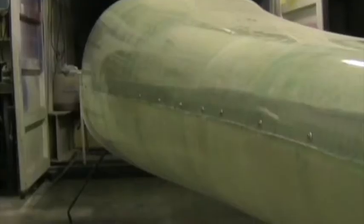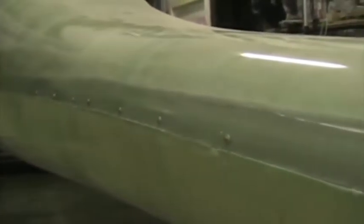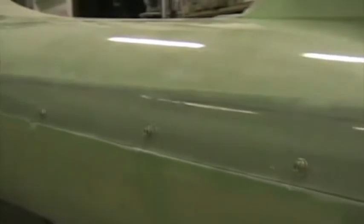Three screws are in and now I'm going to do the other side. The important starting point is to get the cowling joggle to line up precisely and work from here backwards. Left hand side, right hand side and alternate. All the screws are now in. Top and bottom halves are now temporarily joined together.